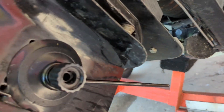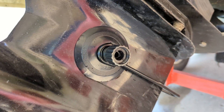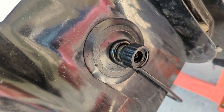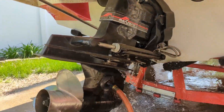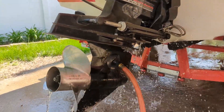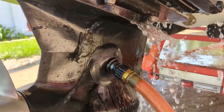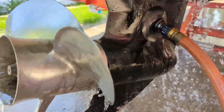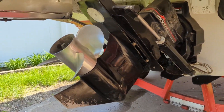Pull them up so that they cover all those ports, just like that. Then you hook your garden hose here — just a regular residential garden hose — turn it on, and that supplies the boat engine with water. I don't turn it on too crazy, just enough so that some water leaks past the seal so you know there's positive pressure in there.